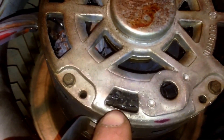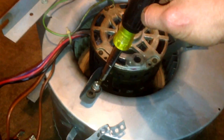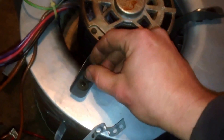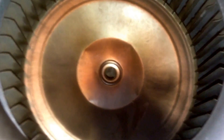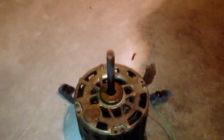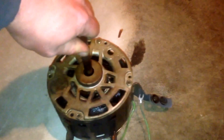Luckily this device was able to be shut down before it actually caused a major problem. We've got our motor shaft — take your rabbit ear screws loose, there are three of them. Once you've got these loose, you should be able to pull that motor out and drop your new motor in. Here is some more evidence of the burnout: we've got soot all over this blower centerpiece. If it wasn't obvious because the motor had started on fire, I should be able to spin this shaft very easily — and it's not moving at all. She gets tight pretty quick.